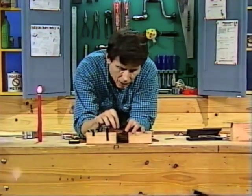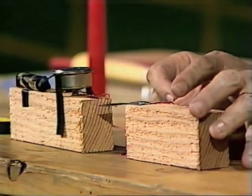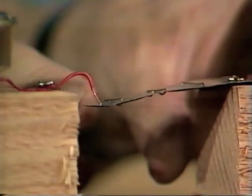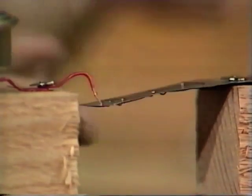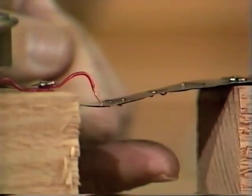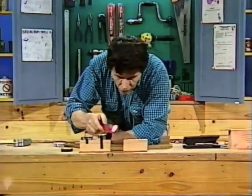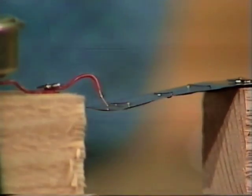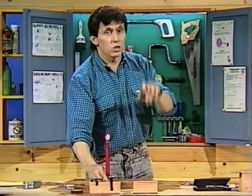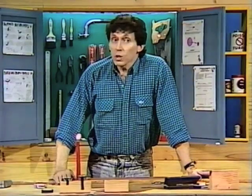So I'm going to bring that in again and adjust it so that the strip is just touching. Then I'll back it off just a fraction — so now the wire is not quite touching the bimetallic strip. There's a tiny gap between the two. Just not quite touching. What will make it touch? Well, if some source of heat causes the bimetallic strip to bend upwards, maybe it'll trigger off and work as a fire alarm. Let's see if the candle will help us here. Here comes the fire — let's see if the alarm tells us that the fire is near. Fire goes in, alarm goes off. And each time the flame goes in, the alarm goes off powerfully. In fact, some real fire alarms work on the same principle — they have a bimetallic strip to trigger off an alarm, a flashing light, or a signal that goes to the fire station. So that's a little bit about fire alarms.